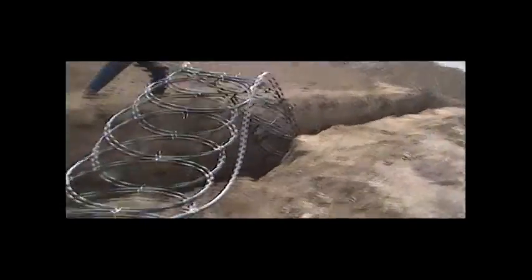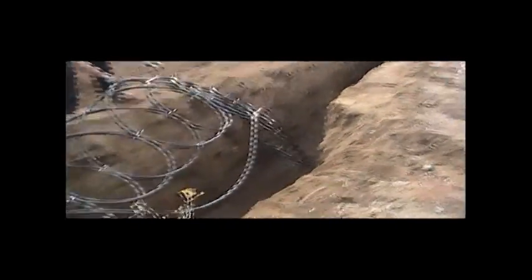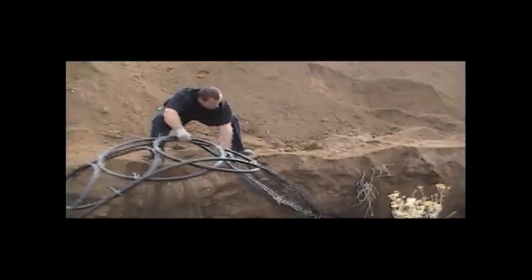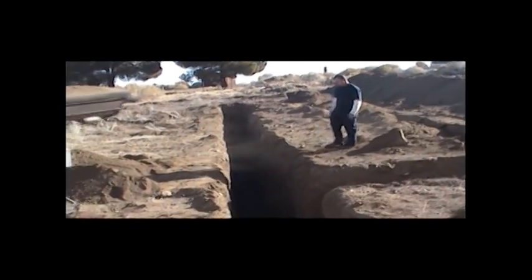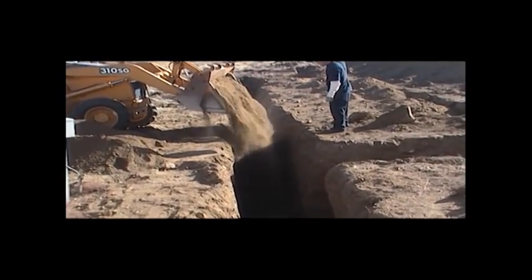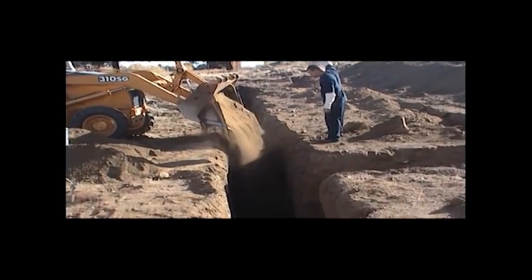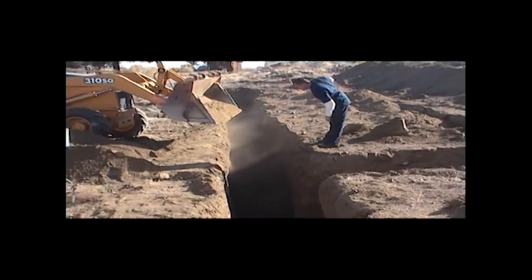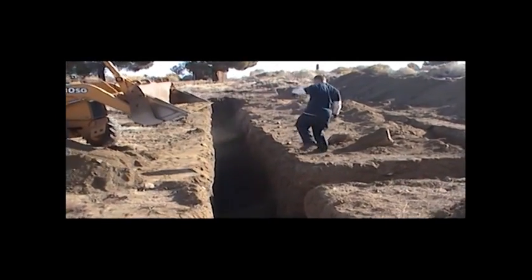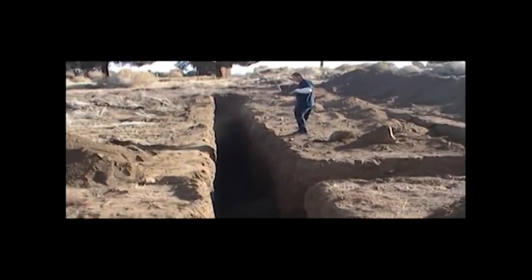We're dropping the first set of slinkies into the first trench. It's Saturday, December 3rd, 2011. We've got the last coil on the ground. Here we're shading the pipe with sand to protect it during the backfill. They pour sand on one side of the trench, then pull back a little and pour on the other side until the pipe is completely covered, then shift down a bit. You can see the coils down in there — there's the first load of sand, and here comes the second.